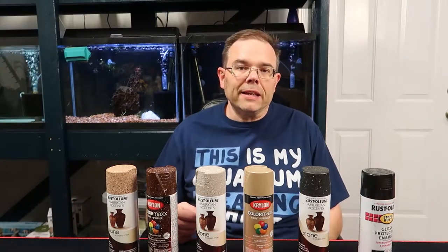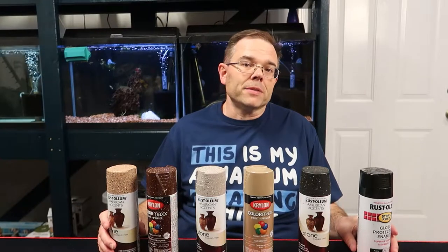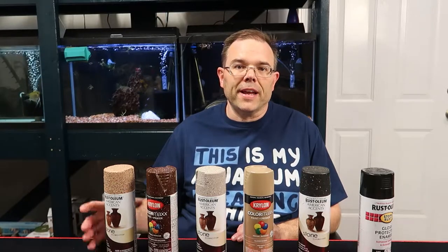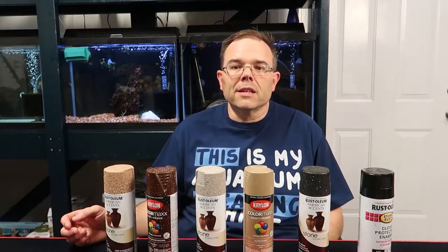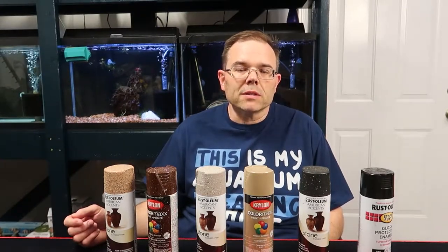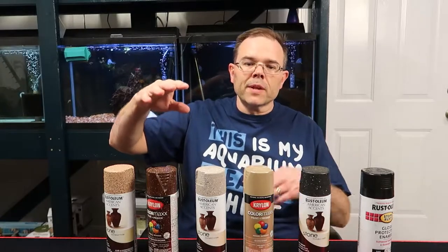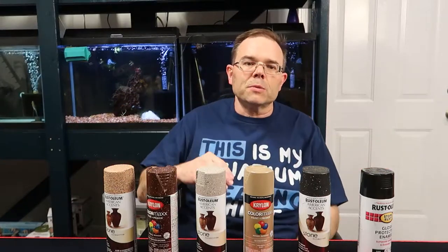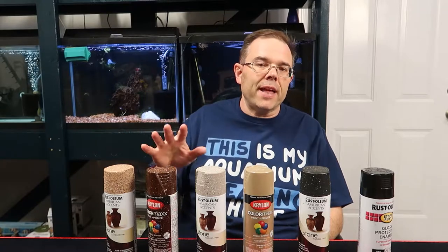A few things I'll add in here if you've watched it this far. You can get some bonuses, right? I said the paint was taking a long time to dry on that first one. Well, what I figured out was you need to blow a fan around the area so that it's not stagnant air. And then the paint dried in hours, or certainly a day. It was very dry. And within a couple hours, it was easier to overcoat it. Because as you go over it and it's wet, the paint splats into the other wet paint and pushes it out of the way. So it's better to do light coats and let them dry a bit between. But you've got to have that air moving.